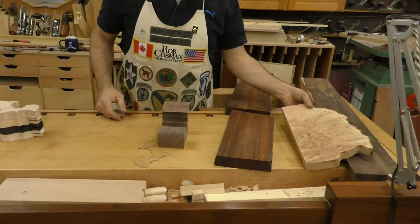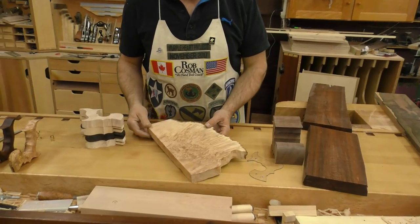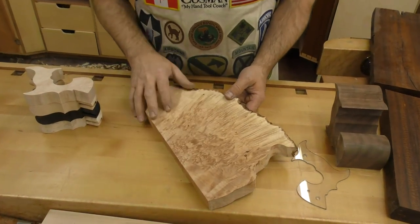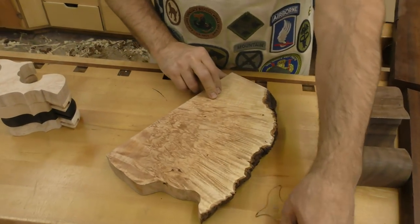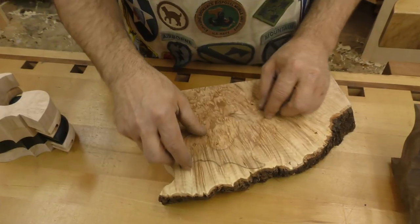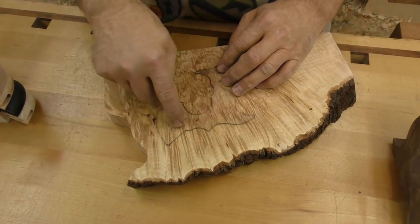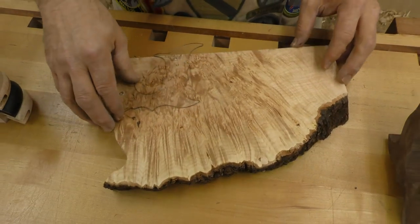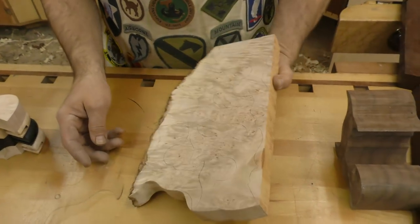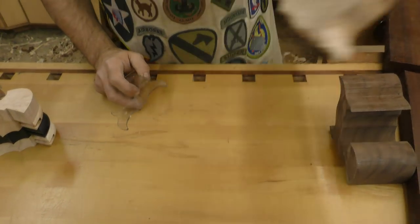So we finally get a good piece of wood. Here's a piece of really pretty maple burl. I actually hand planed and put a finish on this side just so you could see how nice it is. My template for the handle is a piece of plexiglass. It's very important that I get the grain running parallel to this section right through here in order to have enough strength. So I've got to lay that out, and as you can see on the other side I've already done that — this will give me what I hope is the best yield out of this piece of wood.